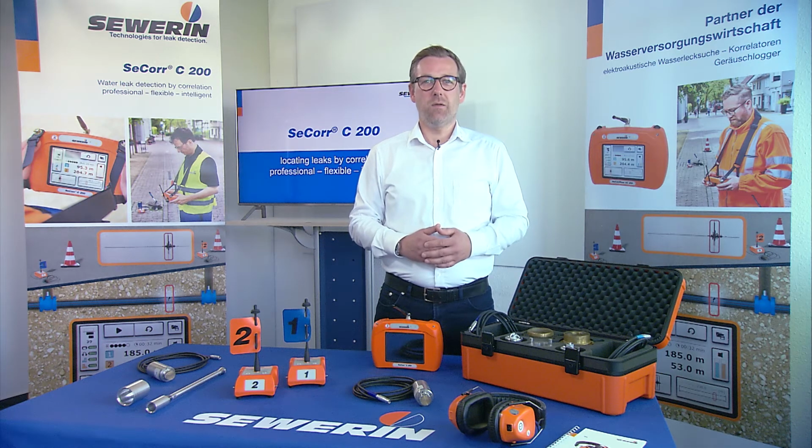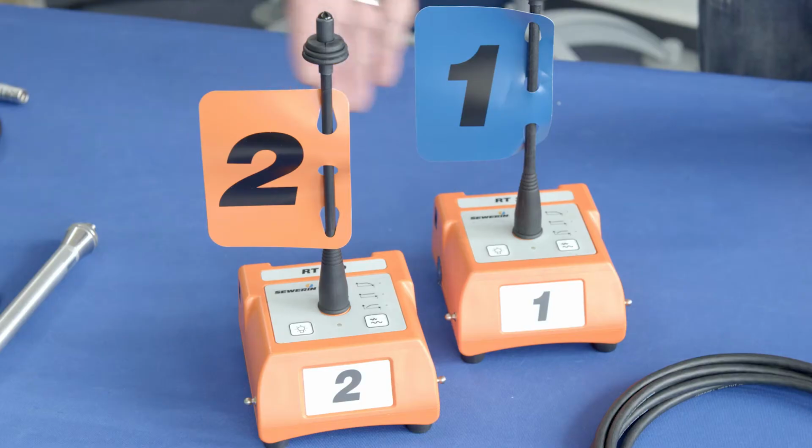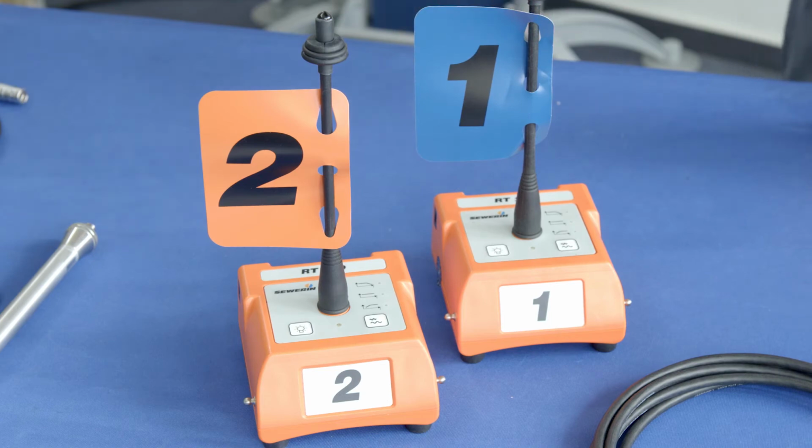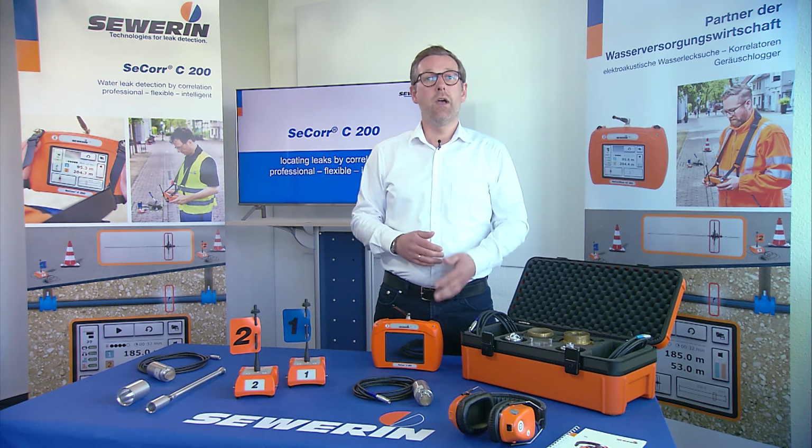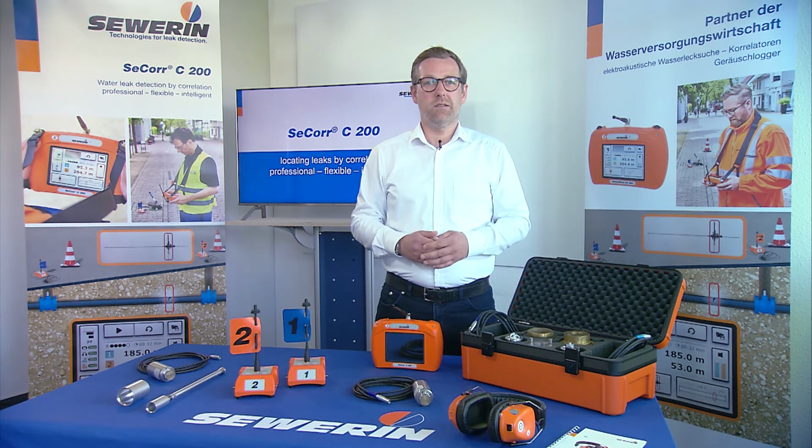In addition to the C200 receiver, the SeCorr system also includes the two high-performance radio transmitters RT200. They enable the low noise transmission of leak noises from two measuring points to the C200 over several hundred meters.